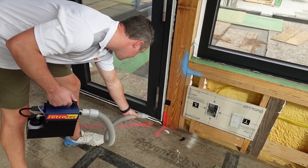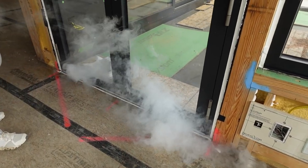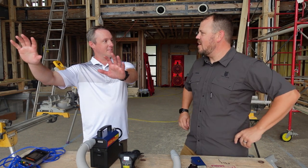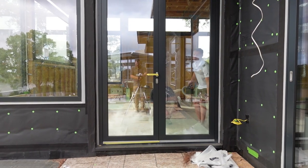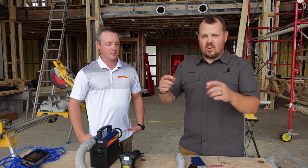That's great for going around and spot checking. Even if you have a finished house, you can have interior doors open, and if that room's on an exterior wall, you can discharge the fog into the doorway. If you're pressurizing and that smoke moves in, you know you've got something to focus on in that room. You can work broadly or be super specific.